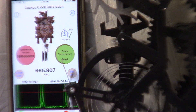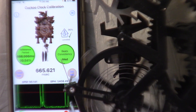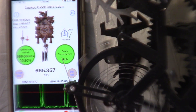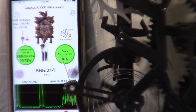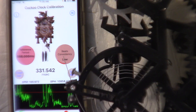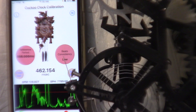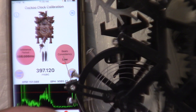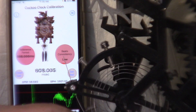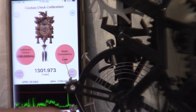So this is the beat I'm getting right now — maybe two minutes fast per 24 hours. The perfect balance is between the spring and the weight of the balance. I've got bolts, and I have longer bolts and nuts to increase the weight.